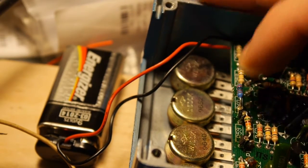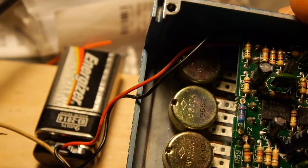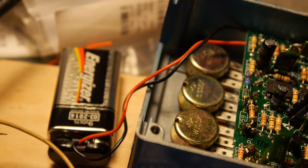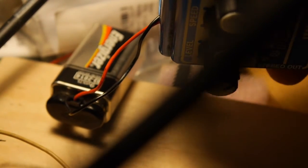So we're looking at R60. Swap it out from 15K to 2K, and you can get it going a lot faster. DoD Icebox Stereo Chorus, FX64.